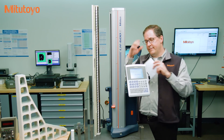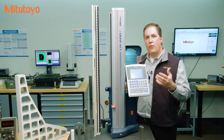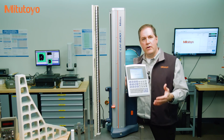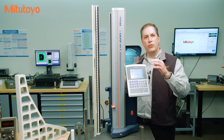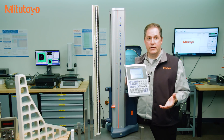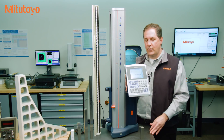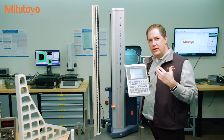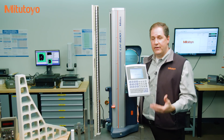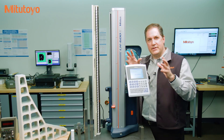So much for the theory — let's get more practical. What the second part of that definition is saying is that calibration really begins with an understanding of how you are using the measuring equipment. As the owner of the measuring equipment, you need to realize that how you use that equipment impacts how it needs to be calibrated, and since not everyone uses measuring equipment in the same way, that leads to different organizations having different understandings of calibration practices. What we've learned here at the Metrology Training Lab is that there are five very different activities in practice that are commonly called calibration.